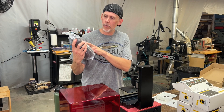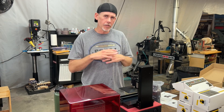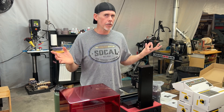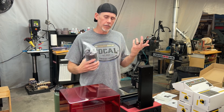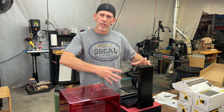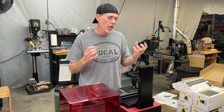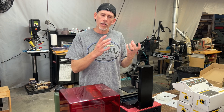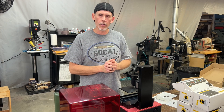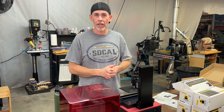I have some of the water washable UV resin — it's from Elegoo, same brand as the printer. There are lots of different brands of UV resin and, as far as I know, you can use any of the UV resins out there. I went with this one and the water washable type seemed like a pretty easy way to go. After the print is done you need to wash off all the uncured resin so it doesn't cure on top of the print. With water washable you literally just dunk it in water. The other way most resins work is you wash it off with isopropyl alcohol.